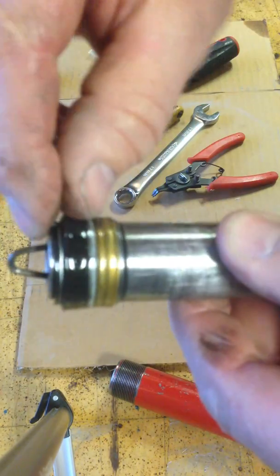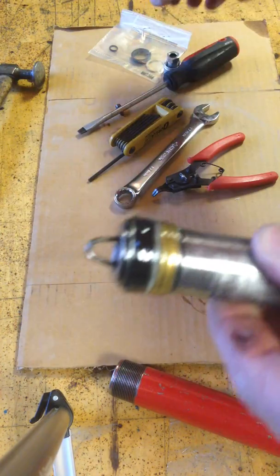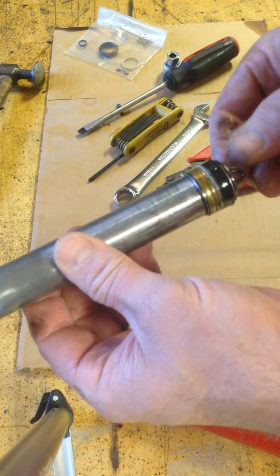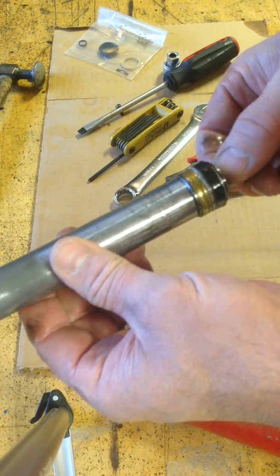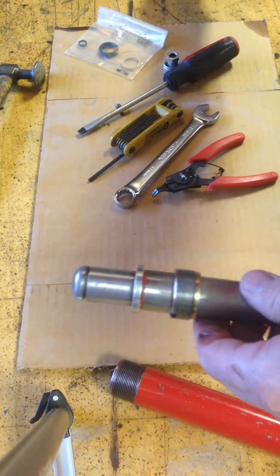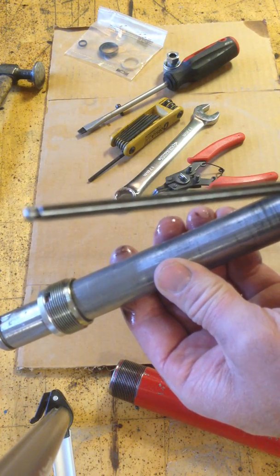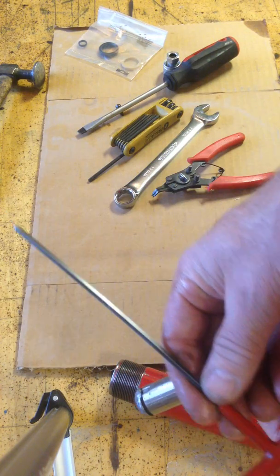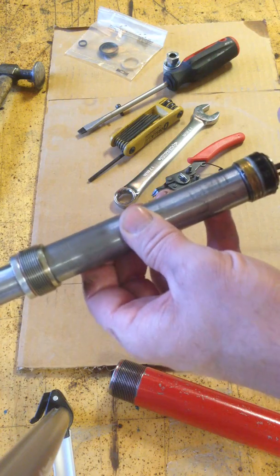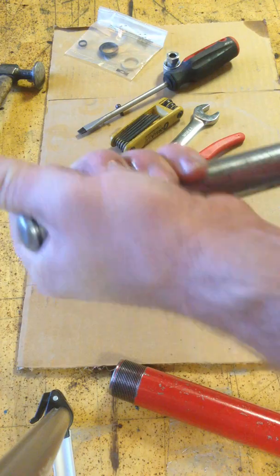The seal comes off, the plastic shim comes out, and those are both included in our kit. The other issue that can happen is the spring can come dislodged, and at that point the spring would probably fall out. Inside the spring you need a three millimeter or a 5/32 very long hex key, and you can reach up into that spring — there is a set screw holding the spring in place.